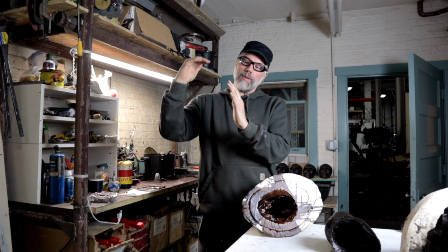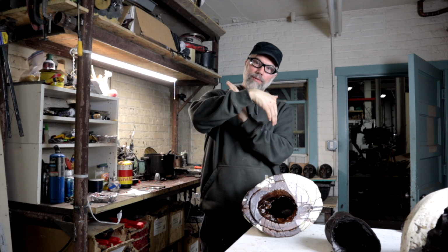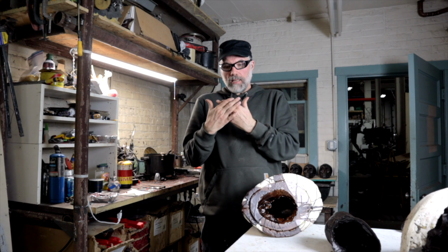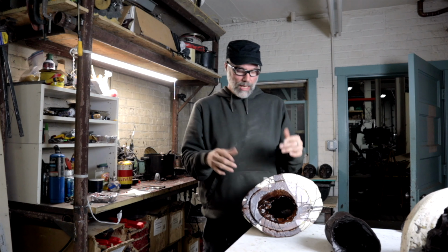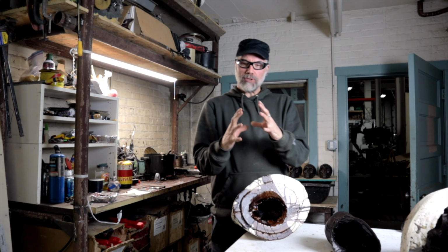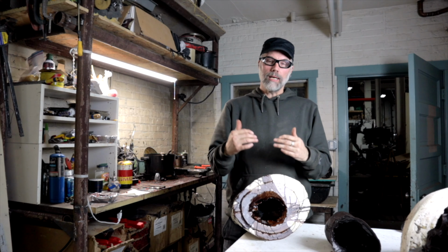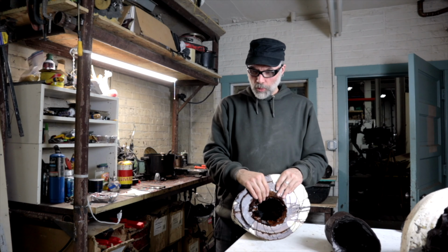And so when we go in and pour the next coat of rubber, there's a chance that it's going to flow behind your first coat and the rubber, and it just screws things up. It winds up melting the previous layer. You wind up getting a weird delamination look or multiple layers. Anyway, it's just not good. So what we want to do is do whatever we can to keep the wax trapped out on the edge of the molds until the end of the casting process, and then we'll trim off that wax to reveal the ultimate thickness that we're shooting for. So I'm going to let this cool down.